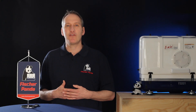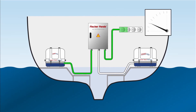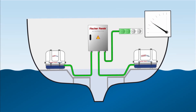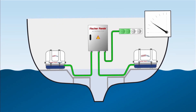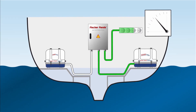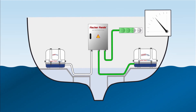If you're connecting two different I-Series generators together, be aware that for load switching, both generators must be able to supply enough power to your loads. If you connect two different I-Series generators, you can combine their power for load sharing. For applications that require both generators to be operating in parallel, you can use additional PLCs — programmable logic controllers — to set up the system so that both generators start and run in parallel automatically.